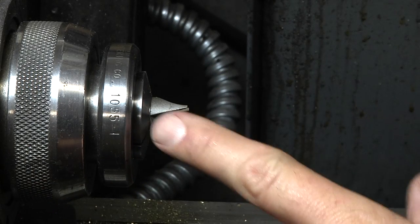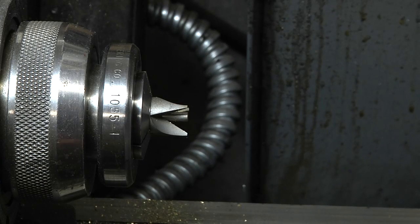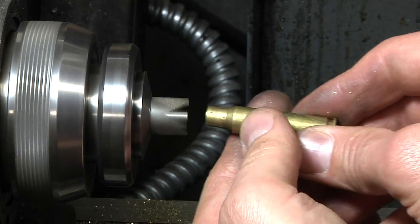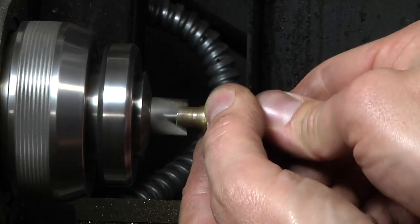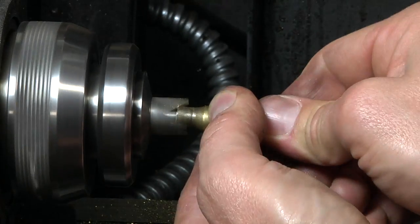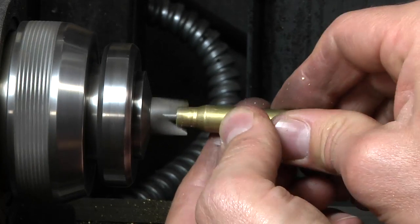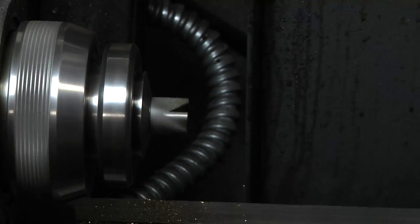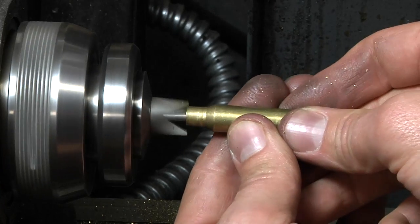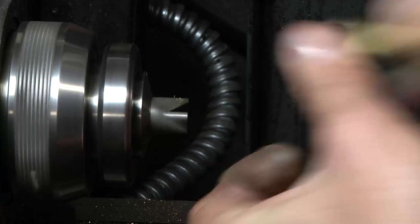I've swapped out collets and now have the outside chamfer tool set for brass prep. This is going to be the last phase before we tumble off the lube. Just like the inside, I'm going to rotate these slightly to make sure I get a uniform chamfer. The important thing here is to make sure we remove all of the flare from the case trimming. It's helpful to look at each one and check for a uniform band all the way around — a ridge line could cause a semi-auto rifle to jam and not eject, which is not what you want.